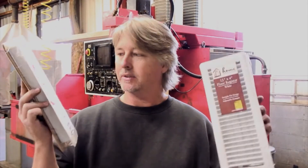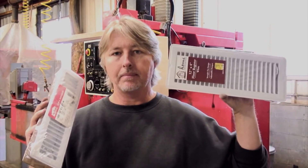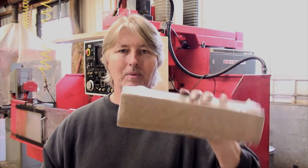We're going to need some vents going in and out of this thing. I went ahead and got these — one bigger one and one smaller one. You can close them off, so at night you don't want a draft coming through. I thought I would go with two different sizes and put the bigger one at the top and the smaller one at the bottom. Since hot air expands, it'll be coming out anyway, but if we can make a nice easy flow coming out, we can pick up a little velocity going in. It just so happens this is the size that a 12-volt computer fan will fit on. We'll probably put a little solar panel and kick a couple fans on there and see what happens. So now I know what size to make my holes and duct work.